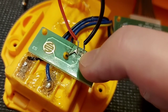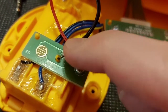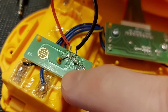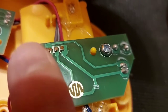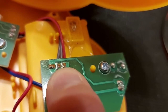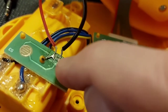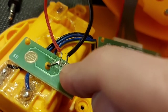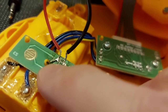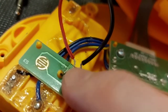What you can see here is that I have short-circuited between two solder points. This is the switch — these little lines show where the circuit is going, leading to these little solder joints. I'm going to show a clearer picture of what the solder joints look like on the other foot. The other side only has two solder joints; this side has three. There's a little gap in between them. You're trying to take the wires and solder separately — one wire connects to the point on the right side, the other wire comes down and connects only to the point on the left side. I did a little bit of scraping there to make sure there's no possible connection between those two things.